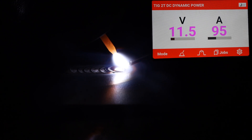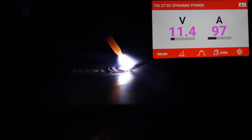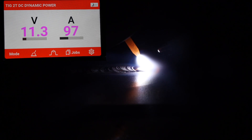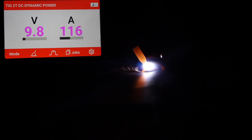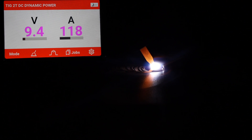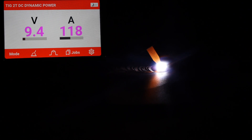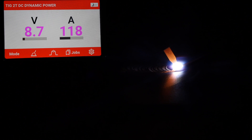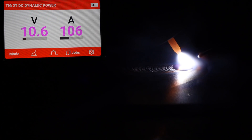I'm not sure this is one I'll use all the time because most of the work I do I have a foot pedal at the bench, but I can really see cases where you may want to use this to give you a little extra control if you aren't able to have a pedal, and to compensate for arc length or actually control your amperage a little by varying arc length.